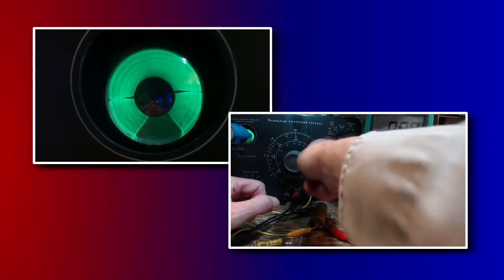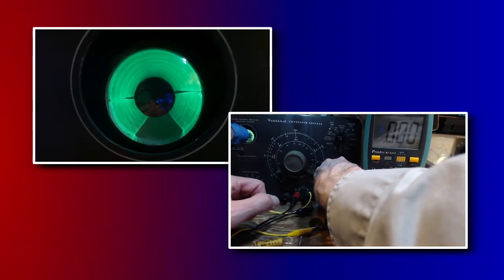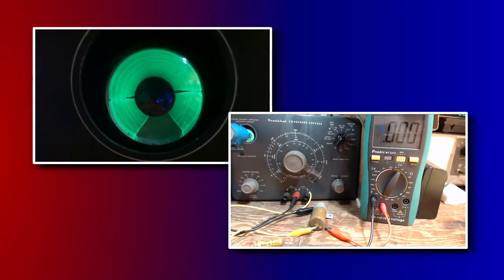Well, back to 25 here. I would rate that very poor, very high leakage capacitor. A little bit of leakage may not hurt in some applications in the radio, maybe where there's not a large DC voltage across the capacitor. But interestingly enough, high leakage and a very inflated capacitance reading from the Heathkit. Not quite so bad reading coming from the digital meter, but the problem, of course, is what's right?